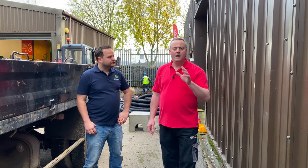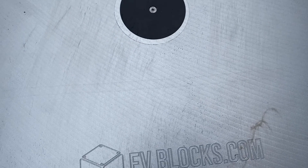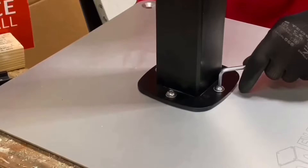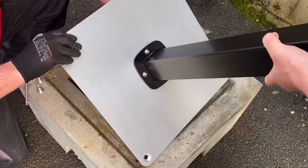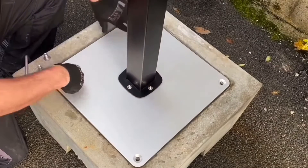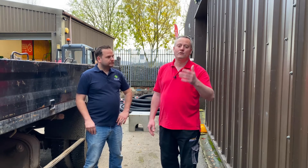That's more work — you've got to dig out the ground and put the pit in just to have that pulling-in point. Another good point you mentioned: the plates on the top can be left as a dummy plate or used to install the post on it. What's the real advantage of those plates? The main thing is that they're universal to all AC chargers currently on the market. So as technology changes, if your client changes their mind two years down the line, instead of reworking all the civils, it's a new plate — change the post and away you go. The bit that's in the ground stays there, you drop off that plate, put a new plate on, perhaps drill some new holes, and you're away with a new post.